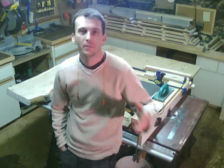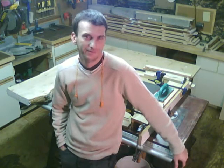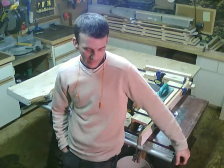I took it to a local mill and had him mill it into 4/4 stock and 8/4 stock for my shop. After a few days, the sawyer, call him Robert, had the lumber milled up for me and gave me a call. I went and picked it up, and it's been air drying ever since. And now I actually have a chance to use it.